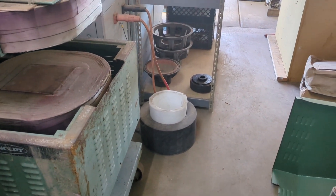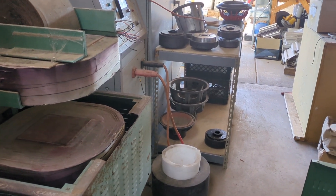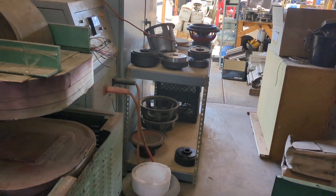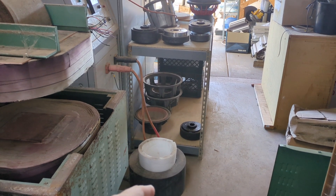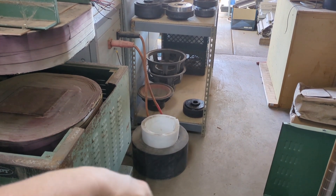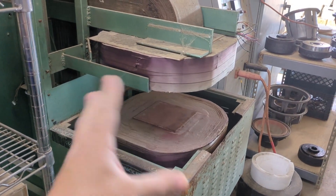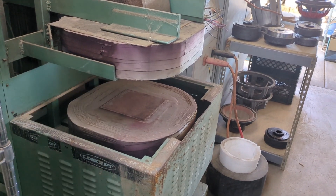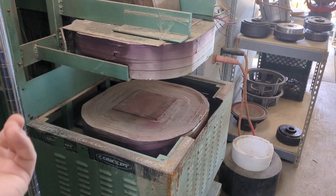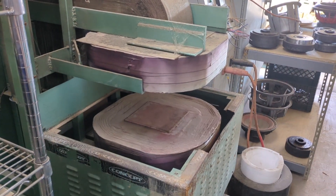One of the problems is if you don't get it exactly right on the equator, the electrical motor force — the EMF — is so strong it'll break the frame. Cast aluminum frame, just shatter it. Jacob at Sundown built padding inside theirs to cushion it because they know you'll be off center. Another way to avoid that is just to have a big coil at top and bottom — expensive, but you put the woofer in between, zap it, it doesn't move, it's saturated and good to go. That's a better setup for production, especially since we don't have three-phase. Love you guys, I'll talk to you later.